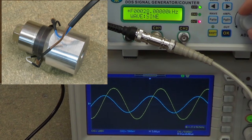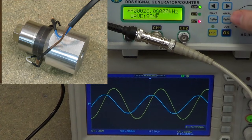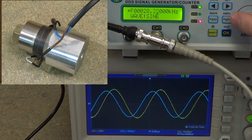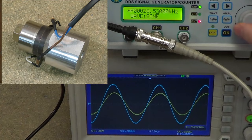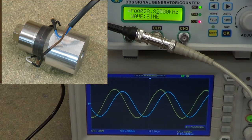27, 28 — something looks to be happening now, so I'll move to a finer adjustment. Keep on increasing the frequency until that point there, which is the resonant frequency, where the current draw is a maximum. If we increase the frequency further, the current decreases.